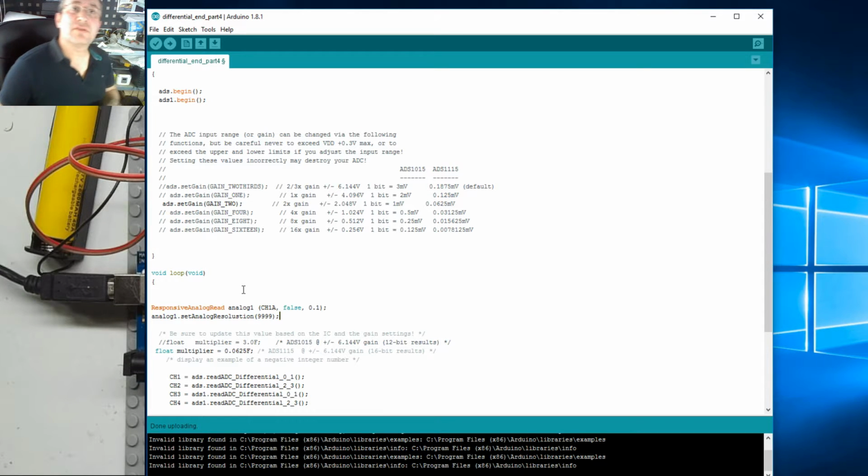The instructions said it's to do with the ADC, how many bits it is. I've tried doing 16 bits and also 65536, which is 16 bits, how many bits our ADC is. Neither seem to work, but 9999 seems to, which equates to the maximum reading of the count. So hopefully I've got that right.